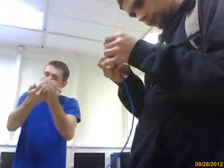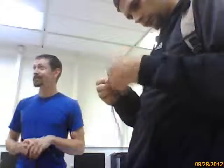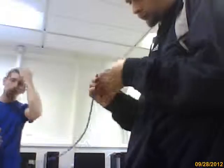They have them out of the way to where it gets pulled back out of the area where the pins bite down through the casing of the wire. It'll tell you if you got open pairs too. It'll tell you, okay, 5 and 6 are open. And what orange, white, orange connects to is pins 1 and 2.